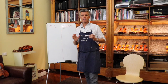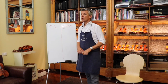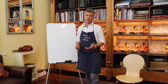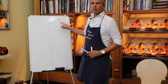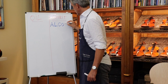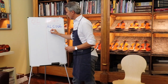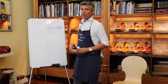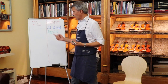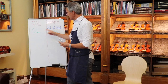Spirit varnish is nothing else than alcohol. Alcohol you could drink, alcohol you can clean surfaces, alcohol you can buy in every Home Depot. Take the most economical one, and even if it's a little bit colored red, be happy — you already have certain red tones in your varnish. So with spirit varnish, the alcohol is the solvent, and into that solvent you put resins. With oil-based varnish, the basic ingredient is the oil, which is also the liquid part of your varnish.